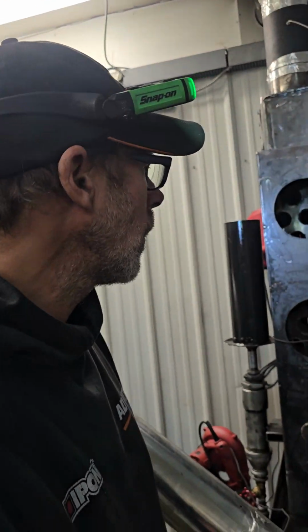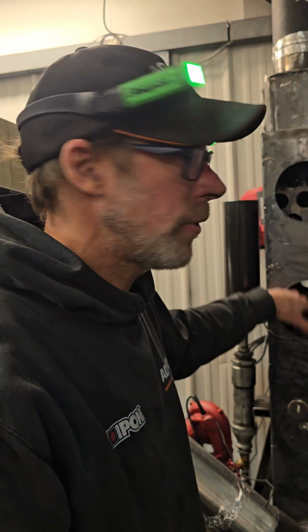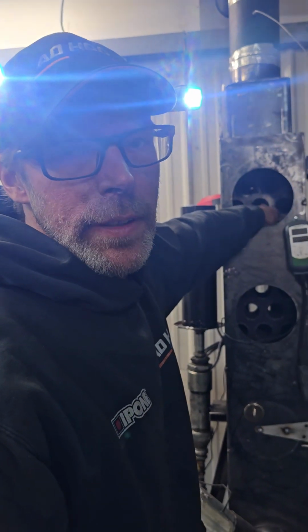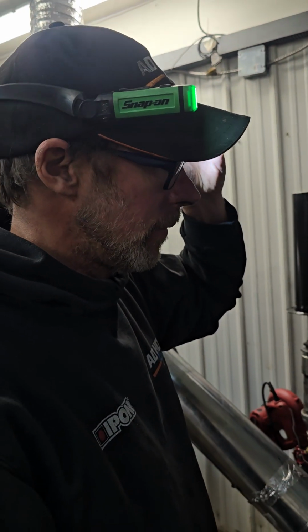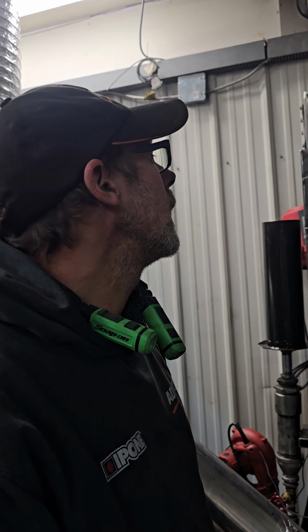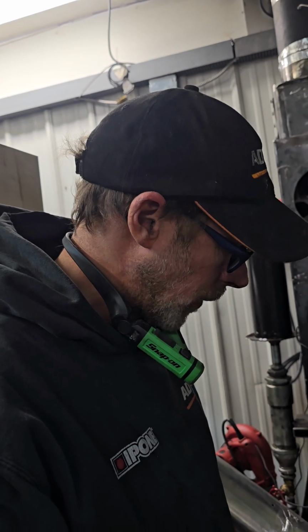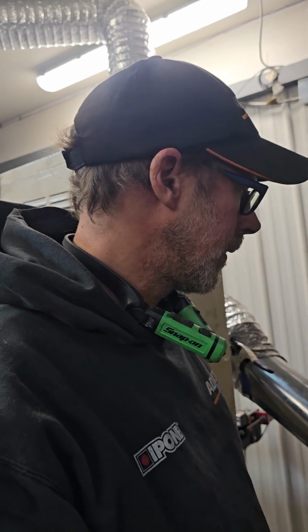And I'm gonna do another one. I'm gonna have fewer tubes because I knew there would be an accumulation of shit inside. There is more than I thought, but excuse me. Anyway, I'm gonna use this for this winter, and I couldn't crank it up enough because I didn't have enough draft. When I cranked it up too much or put the fan to maximum, I had some backdraft and it was smelling inside, so I had to turn it down until it stopped smoking inside.